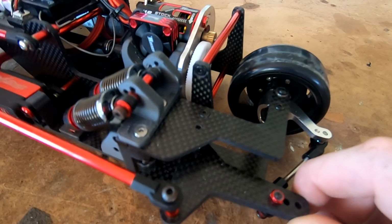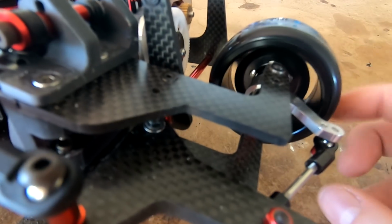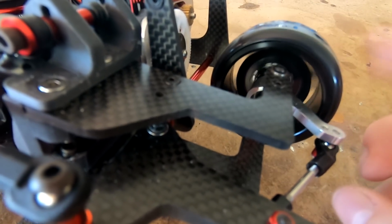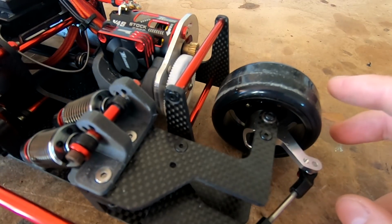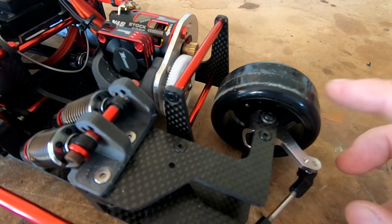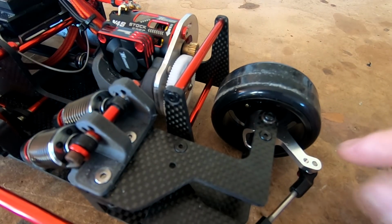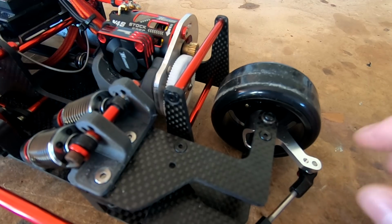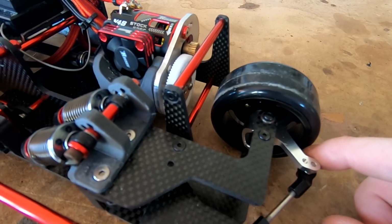We're possibly going to also look at making up some brass plates that bolt onto the inside of the rim, into the bolts that you can see there. We changed the front rim over to an alloy rim as well, which gave us another 40 grams of weight in the front, which has helped as well. But we were running about 100 in total last time, so we're hoping to get a brass spacer machined up, which will give us that extra 60 grams to bring us up to the 100 grams we were running on the nose, and hopefully give us a little bit more front bite.